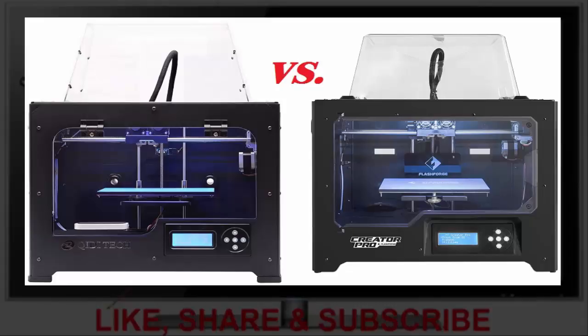Both have sturdy metal frames and use similar components. The primary difference between the two printers is the main board. Although the main boards are quite similar — both being variations of the mighty board architecture — the FlashForge uses an ATMEGA 2560 while the QIDI uses the 1280. There is no performance difference in the chips; the 2560 is simply a larger flash size which, while a nice feature, does not actually have any advantage over the 1280 at the moment.